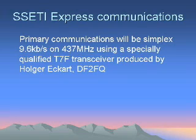So it will be FSK data downlinking, and then when it switches over to voice band operation, it will be a single channel flying FM repeater with 437 megahertz on the uplink, and 2401.840 megahertz single channel FM down. We would much, much prefer to have been flying a linear transponder, and I'll tell you a bit about that in a moment. But that's what we were effectively asked to provide for our involvement in this. So this is what we will be flying.